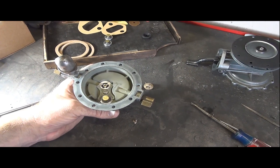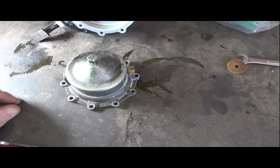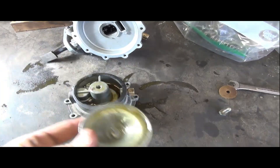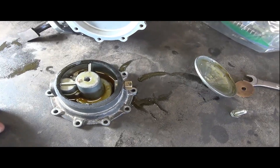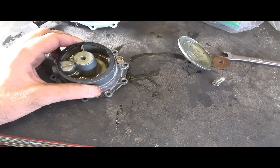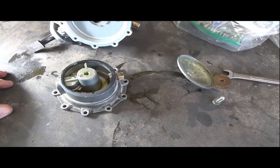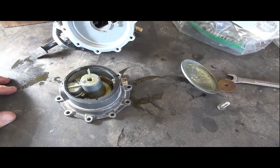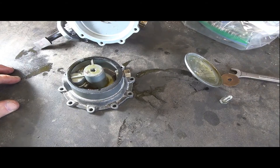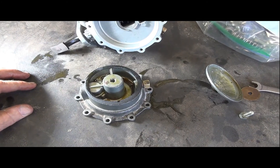Now on the vacuum assist pump side: when I removed the cap I noticed there's actually a fair amount of heavyweight engine oil inside. I'll have to dwell on how that's getting in there — perhaps it's just extra oil being sucked through one of the other lines. Anyway, I'm going to clean it up, replace the valves, do the gaskets, and get it back in ship shape.